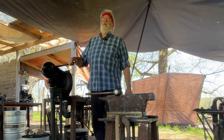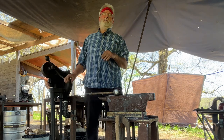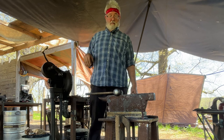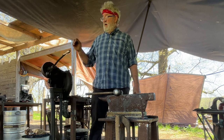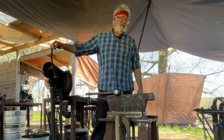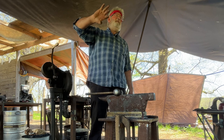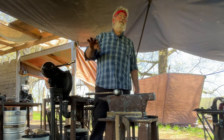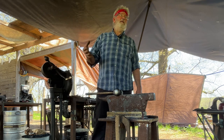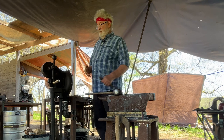When you do the ear, if you're going to bend the neck drastically, where it looks like a horse standing, you know, with its chin kind of tucked down, if you chisel and fuller your ear before you do that, it'll stretch it and make it look awkward. So it's best to bend it and then chisel and fuller for a sharp bend.